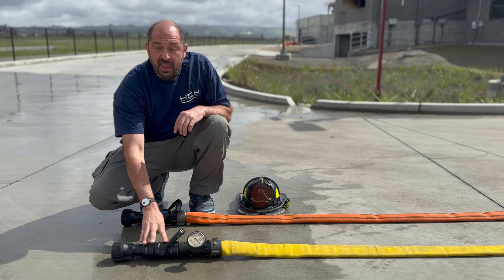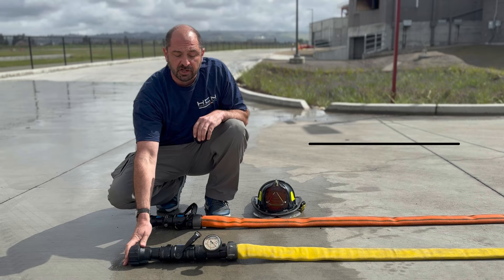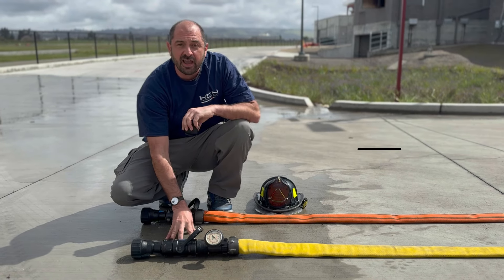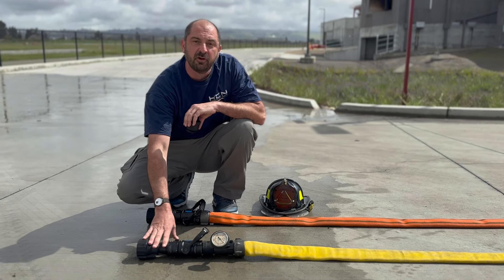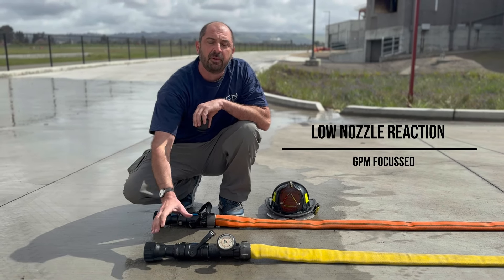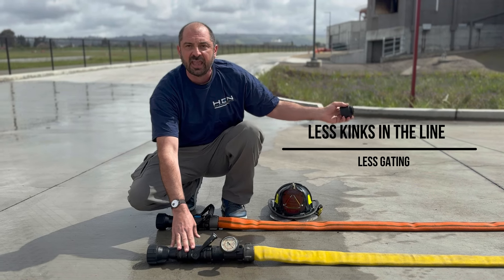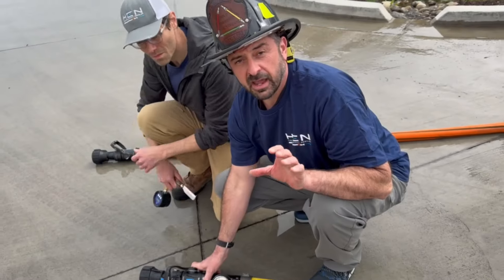What you see here is a HEN 160 blade nozzle — it's designed to flow 160 gallons per minute at 50 PSI nozzle pressure. Right behind it is the HEN Turbo, designed to create 25 PSI of back pressure. This device dissociates nozzle pressure from back pressure — a truly breakthrough design for people who want a GPM-focused, low nozzle reaction line but want their hose and fire engine to perform really well: fewer kinks, better governor performance, less gating. This is a big advance in handline attack package design.